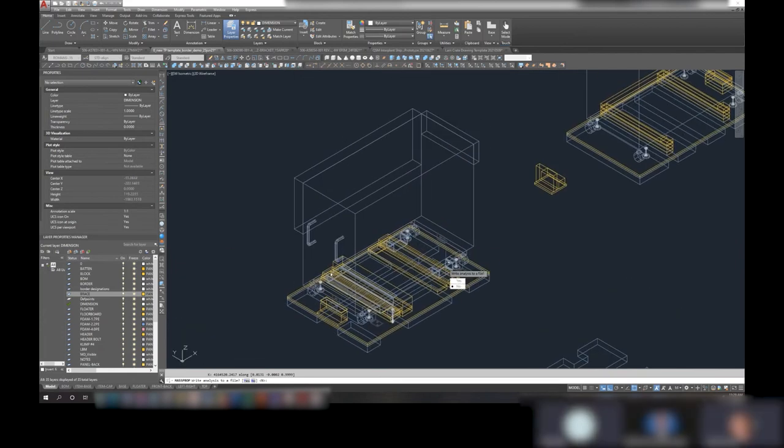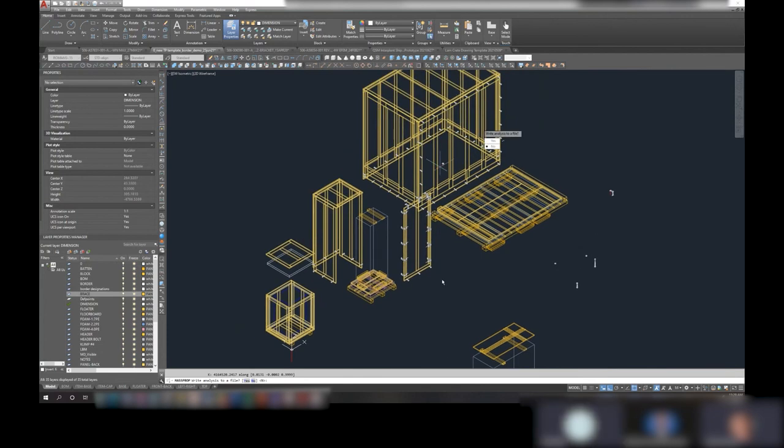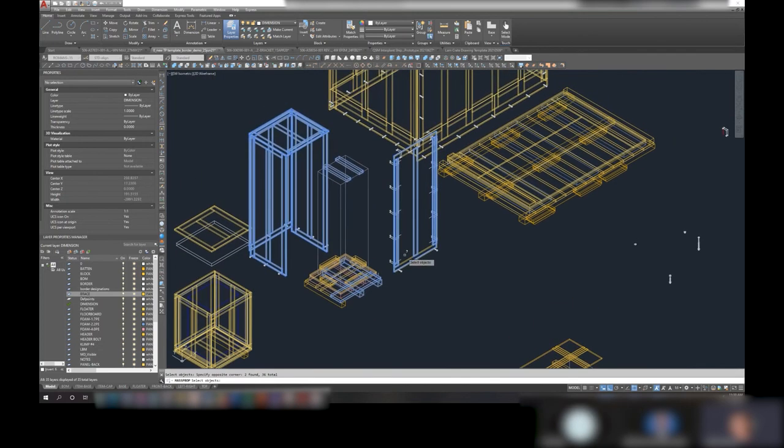So this one is the calculation of the wood, and the weight. So when people ask you, hey, how heavy is your empty crate? Then you key in the mass prop. Understand? You select this mass prop, then calculate all the wood. Select all the wood inside that you need to ship out. All the wood, skid, all the blah blah blah. Only the foam you don't calculate, because they count by volume. Okay. So when you get that, you divide by 1728, then you multiply by 35. Then you will get the weight.